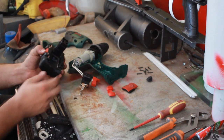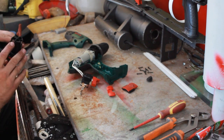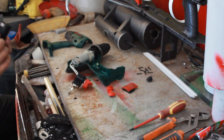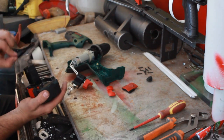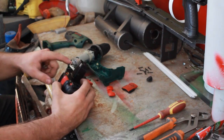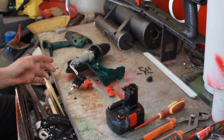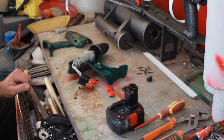As far as hooking the battery up to the cables, what I'll be doing is drilling a small hole in each one - not the rear terminal, that's for charging, you don't really have to worry about that. But these two terminals - that's positive and negative - and I'm just going to drill a hole. When you go to put it on, you just put alligator clips from the minigun onto the battery and that's how it'll hold, because we don't want to do anything permanent here because you're going to want to recharge this thing. That's pretty much it. I'll take photos so you can see where I cut and how I cut.